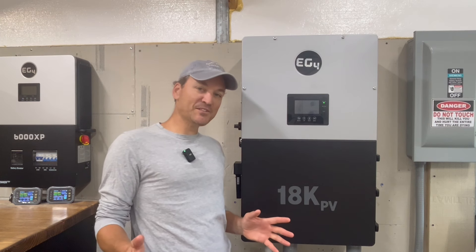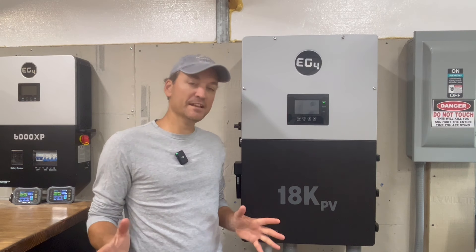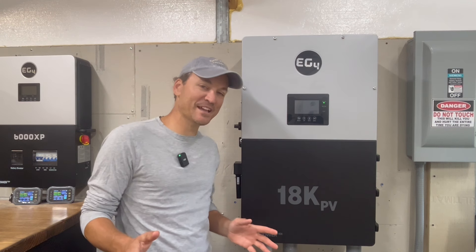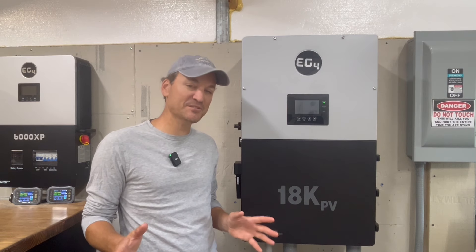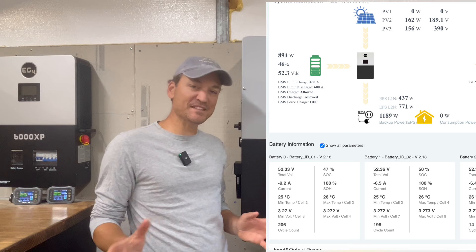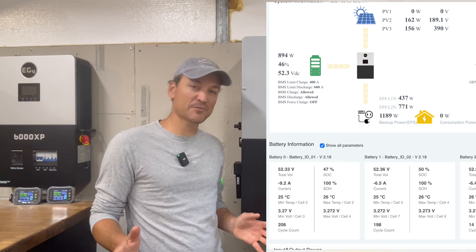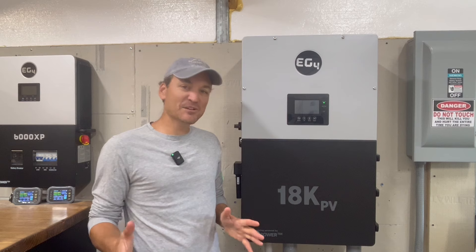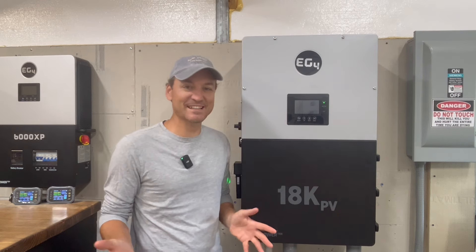The next morning I saw the lightning map showed a strike right near our house, somewhere very close to our largest array. I was happy to see there was no damage to the actual array. But looking on the monitoring app, I could see there was zero wattage on PV1, which is my largest array — the one built as a roof. So I'll go into briefly how I diagnosed the issue and then remedied it temporarily.